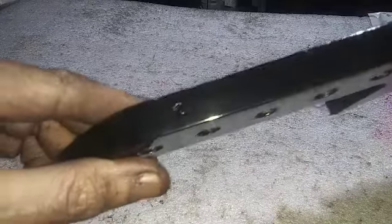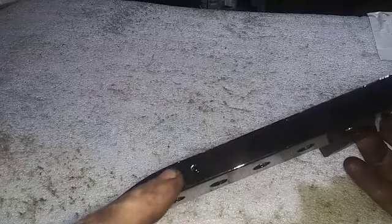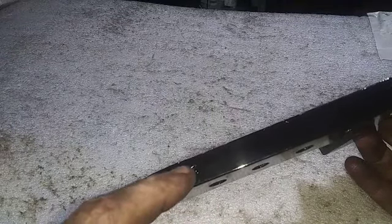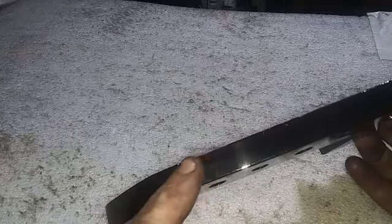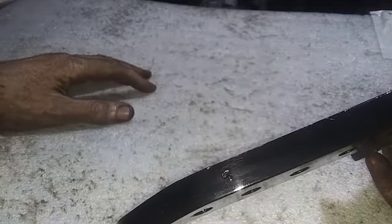So that's what the lacquer, just the black lacquer, did for that. And I'm thinking maybe I'll just leave it like that. I don't think there's much I could do, short of if you sanded and then continued to fill with lacquer and sand gently, 2,000, 1,000, whatever, until you got this even and filled with black, and then clear coated over that area again. That would be about the only other option. Basically a spot refinish on the whole section kind of a thing. But I think I'll just leave it like that.